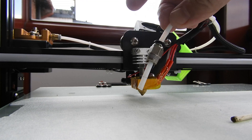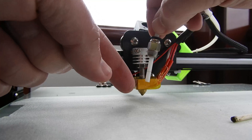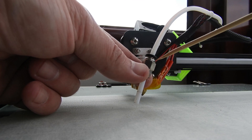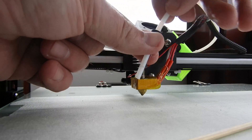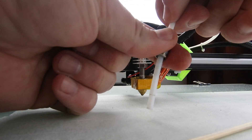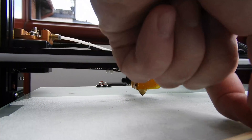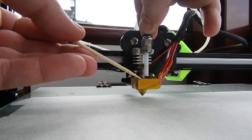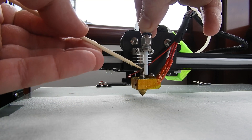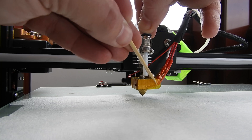What you must do is just reconnect this part — the PTFE tube from the coupler — because we have problems with this connection. When the printer moves, it makes the tube go up, as you can see, and that causes problems because it makes some space between the nozzle and the PTFE tube, and here a lot of plastic accumulates that just doesn't want to extrude.